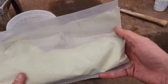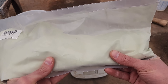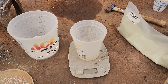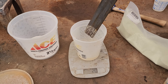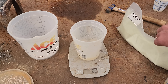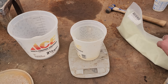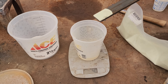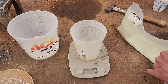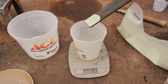I just got this stuff and I'm pretty excited about it — this is bismuth oxide. In the past for my collector metal, I've used bismuth metal, but with the oxide you get a couple of advantages. The first is it has oxygen attached to it. When it comes in contact with a sulfide molecule, it reduces the bismuth to metal and oxidizes the sulfide, producing iron oxide. That helps reduce the amount of sulfides in your ore, reducing the likelihood of getting a matte, as well as getting your collector metal really fine and disseminated throughout the charge. It really helps collect all that super fine gold and silver.